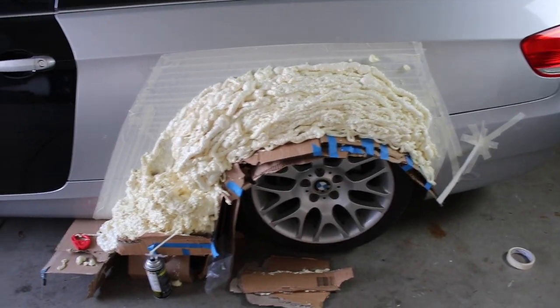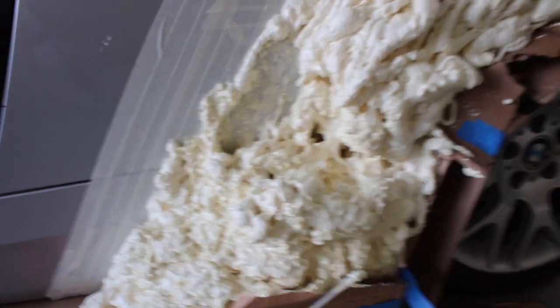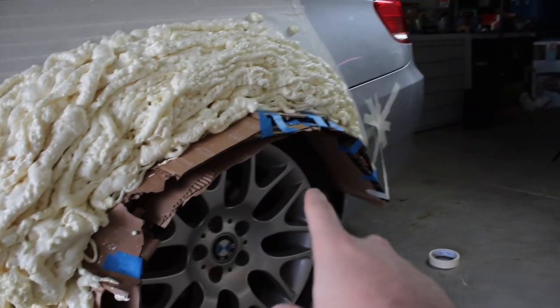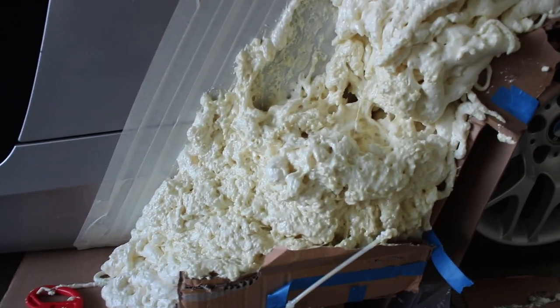I put a lot more — about two extra cans. I'm starting to think I'm not doing this 100% right. This is my first try, so obviously it's not going to be right the first time, but I am learning. It looks like you have to put a good amount, leave it for a few hours, and then put more over the parts that have already dried out. Because when you keep stacking it on top of each other, it just continues to fall since there's no support — it's really soft foam. I'm going to wait for this to dry and then fill in that last section. I'll give it 24 hours.